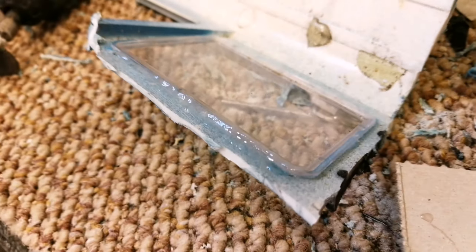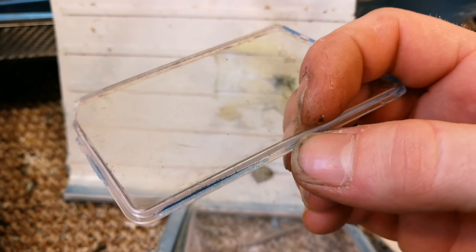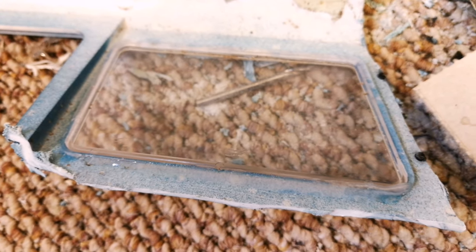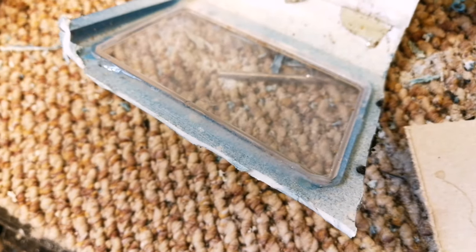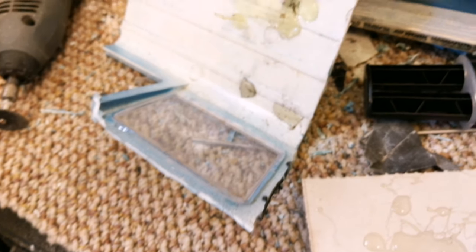We've pasted that onto the joint. If I can catch the light and show you - when that sets solid it's caught on the inside lip of the window. So with this example, we've got epoxy on the wall at the bottom, epoxy on the flat surface, and also this edge epoxied - three edges onto the ABS body. I've only put that one thin bead at the bottom; we'll come back to see how much force it takes to break that one seal, just to show you how strong epoxy can be compared to cyanoacrylate.